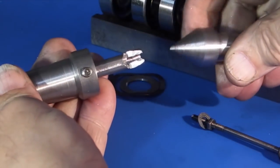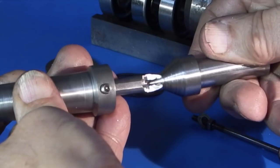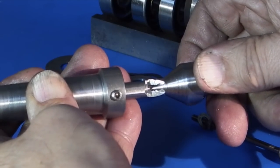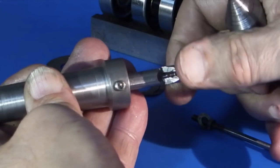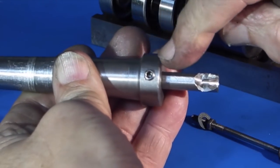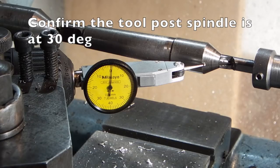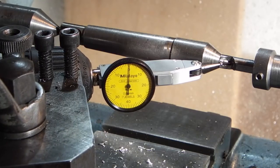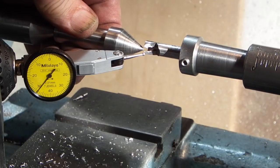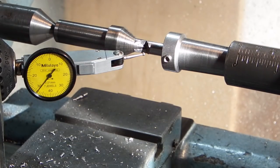Here's the centre and here's my adapter. When that's in there it gives you the edge exposed so I can grind the edge, and it's spring loaded so as I'm grinding off the centre this can spring to keep the tension on. The flat is to stop the whole thing revolving - the little grub screw touches that flat and it's just to stop it revolving. I set the compound slide to 30 degrees and put a dial indicator in the tool post to clock up on an existing centre. You can see now how this spring-loaded setup lets you get at the centre from this side.